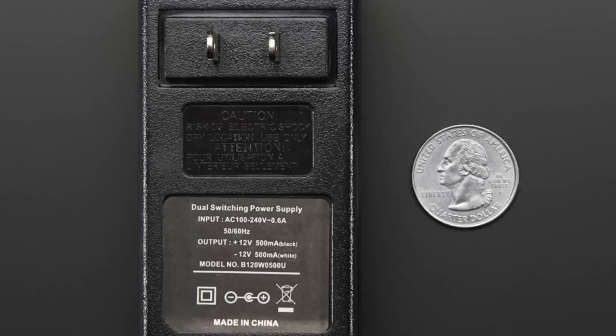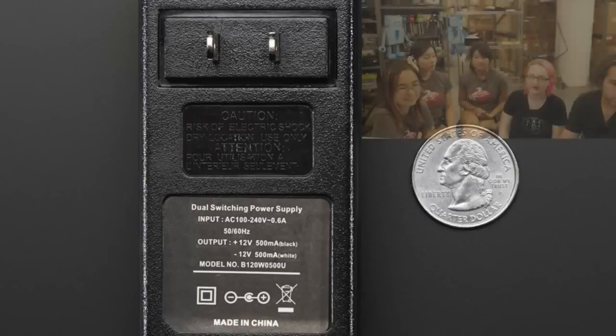If you don't know what this is for, that's fine. But those of you who do know, this is really exciting. I have never seen anything like this. You usually have to get like an ATX supply and they're huge and annoying. But if you're doing galvos that need a split supply, plus and minus references, audio that needs op amps, analog synthesizers that tend to have plus-minus supplies, or delicate sensors that need a 24-volt differential — this is definitely your bag.